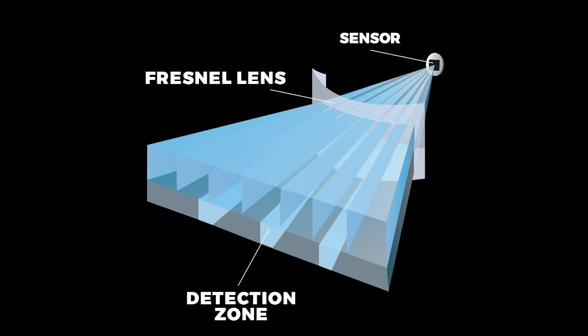Behind this black plastic is actually the PIR sensor. These things have been out for 20 plus years. Most people think that they're triggered from motion — a motion sensor or motion and heat sensor. That's not entirely wrong, but it's not accurate either. A PIR sensor is a passive infrared sensor that detects change in the infrared radiation of an environment.